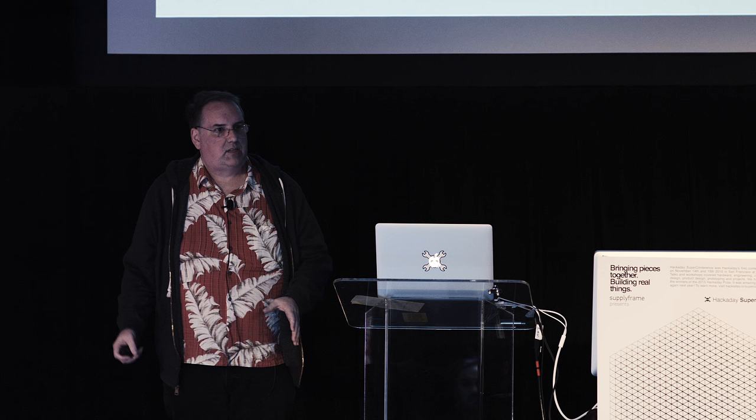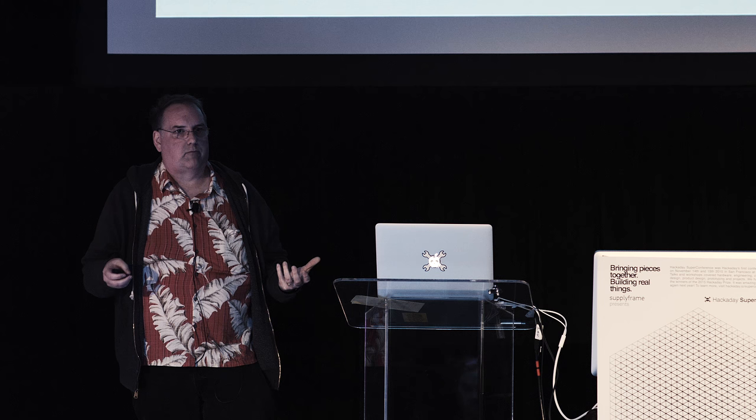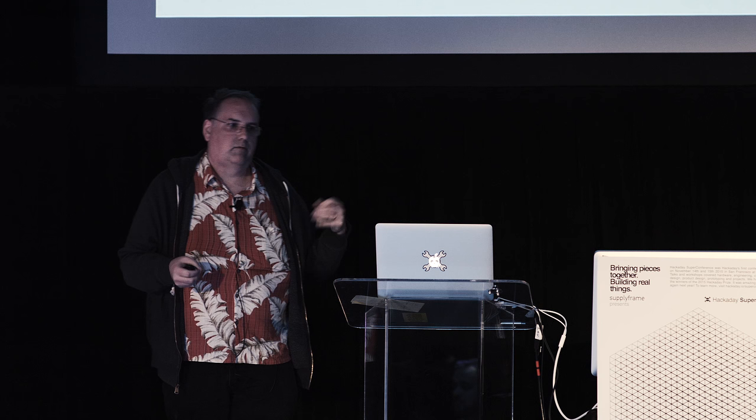But keep in mind that one thing that's kind of nice is that if you have in-circuit programming as a post-assembly step, that does kind of test out part of your system, right? If you can't program the controller, then you know that board needs to be reworked. So that is kind of a nice thing, to be able to program them after you build them.